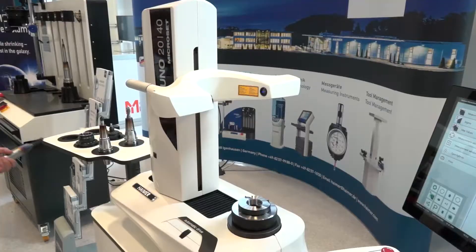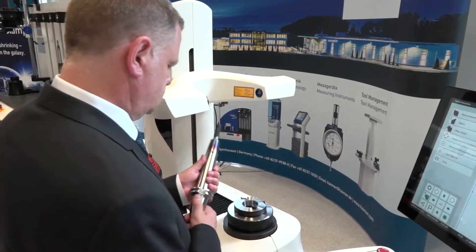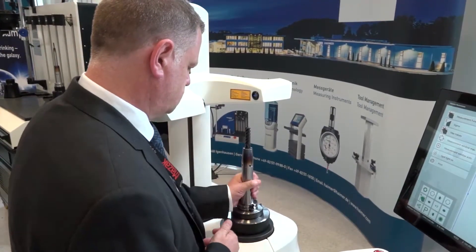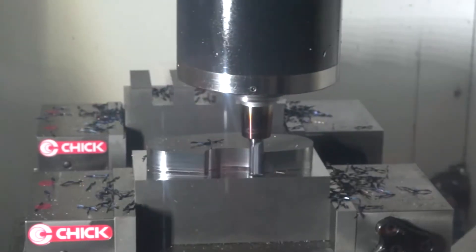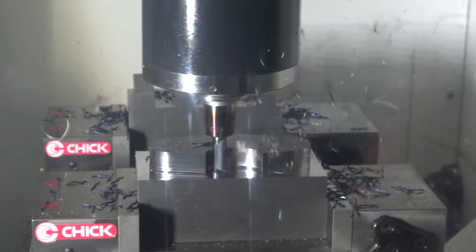And finally, what can you balance? Everything. Think about the car — you balance the wheels and tyres of the car, and you do it once a year because if you don't, everything will vibrate. A car will go at maybe 1,000 rpm, but here many of these machines go 10, 20, 30, 40,000 rpm — and we don't balance.